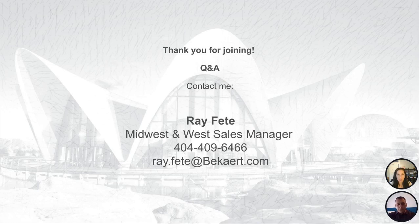And for our folks in the metric system, usually on average between maybe 10 and 25 kilograms per cubic meter. But like Ray said, we really try not to publish an average or what you should expect from a dosage standpoint, because we want to optimize every design project specifically, right? What's the soil K value? What's the loading? What's the joint spacing? What's the concrete strength? All of those factors will lead to an optimized dosage recommendation. We're not just pulling something out of the box that's one size fits all.